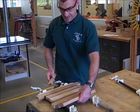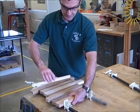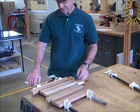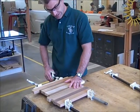I have all my wood cut. I have a nice layout. What I want to do with that nice layout is what's called dry clamping. I want to use pipe clamps so I can push flat down against the pipe. I dry clamp them back and forth.